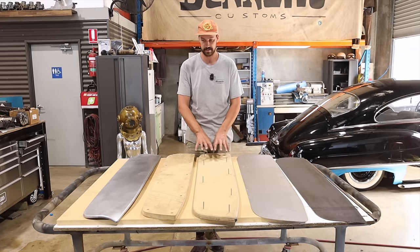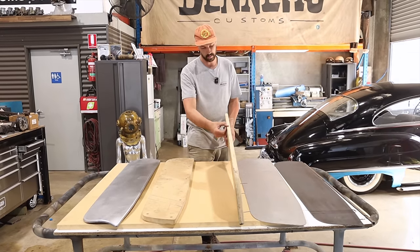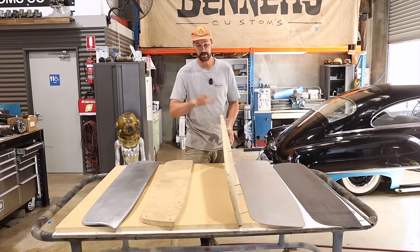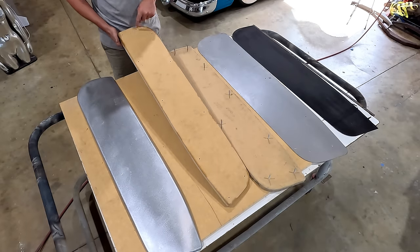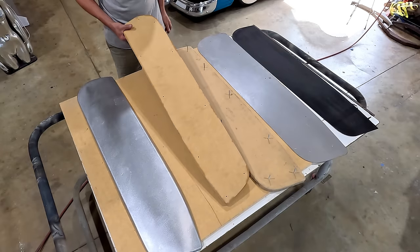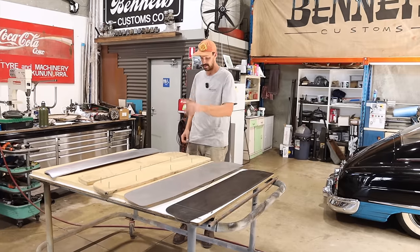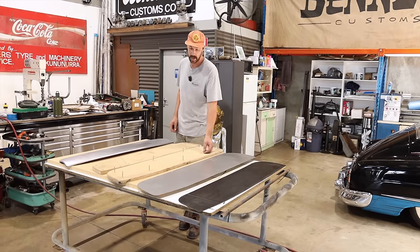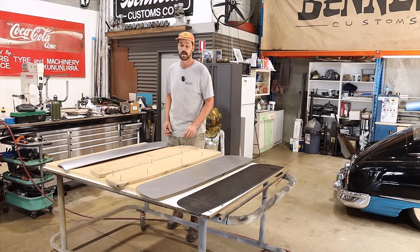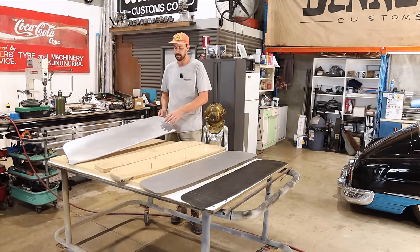Now that I've finished this side, I can then go along and router this edge, and flip this over. I'll just drill these out again to allocate for the taper of the bolt. And I think the right amount of holes seem to work really well, especially going with that 3/16, so it wasn't too much to fill using the TIG welder. I was thinking about it afterwards.